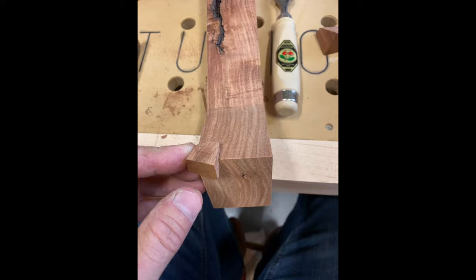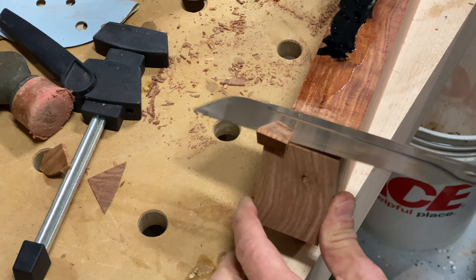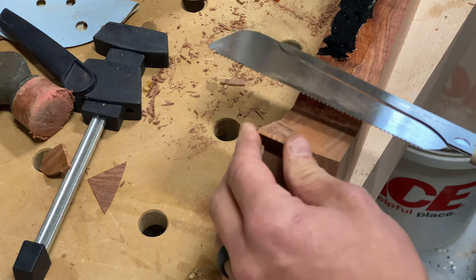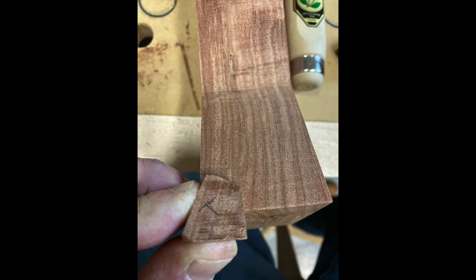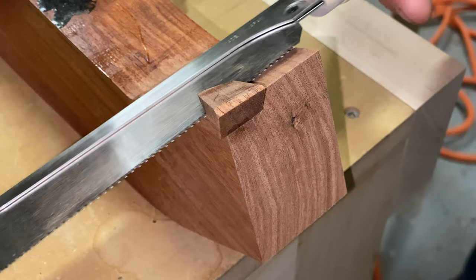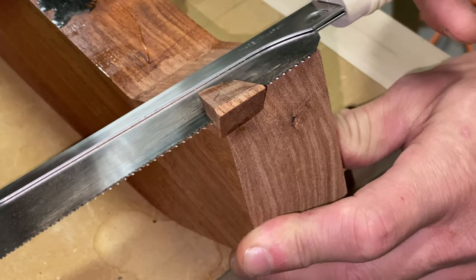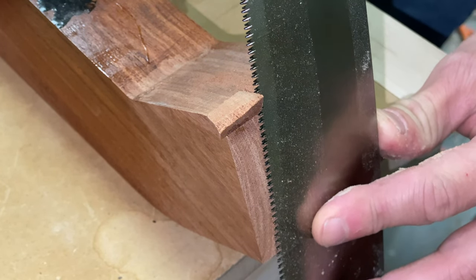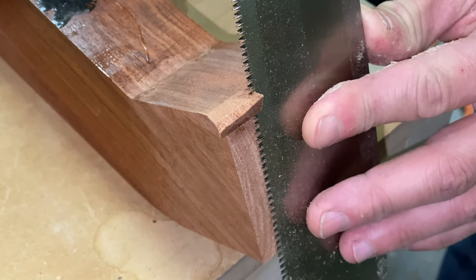Here's one of the pieces that busted off on the router table. I glued it but didn't let the glue dry all the way, so it moved. I had to scrap that one and start over. This time I found a piece that matched pretty well with the grain, used some box tape to get tension on there to help it glue better — and that one's on there solid. Now I'm using hand tools to clean it up: flush cut saws and a different saw that can get flat flush against the bottom.